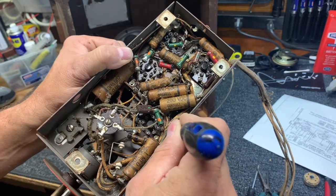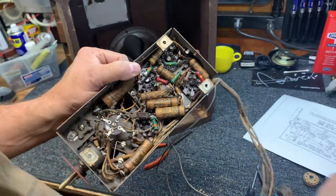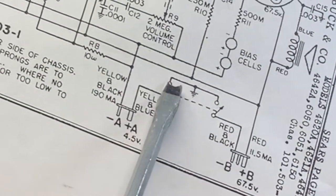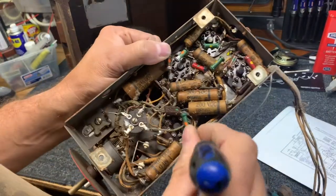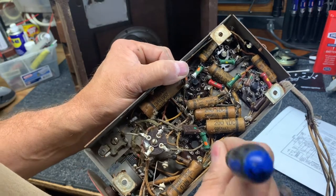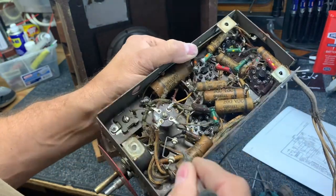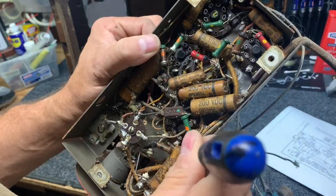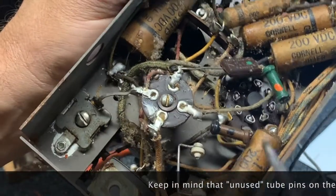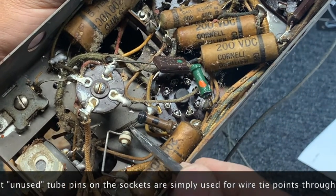Let's look at this yellow with blue wire. Yellow and blue is A plus and it goes to the switch, which is switched to ground — so that's a switch wire. So the yellow with black — where does it go? There it is. It comes over and touches the tube connection that is also connected to our bias cells — the tube side of the bias cells.